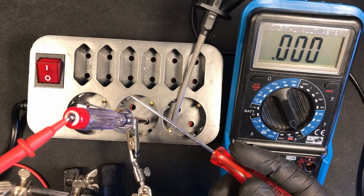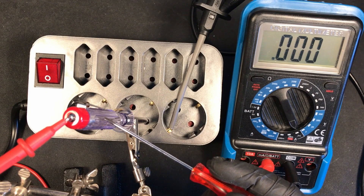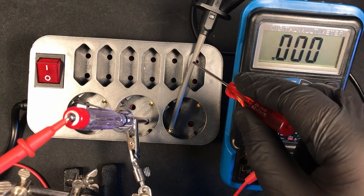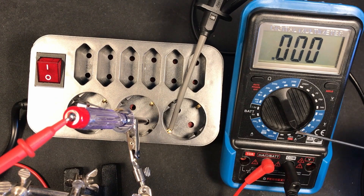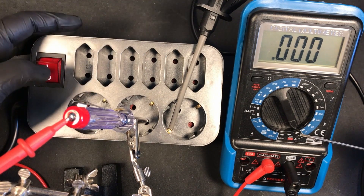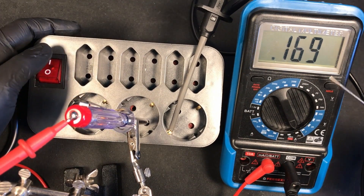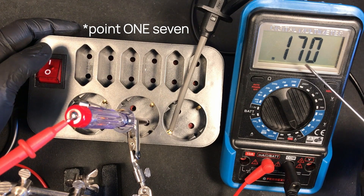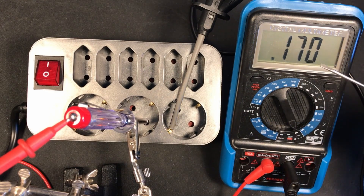In this setup I already got a new tester connected to the phase. The red probe represents my finger and the black probe closes the circuit to the ground. The multimeter here is set to a range of 2 milliamps AC, and when I press the switch I get a reading of about 0.7 milliamps. So that's the maximum current that flows through my body when I touch it.